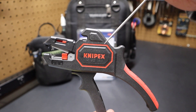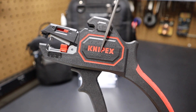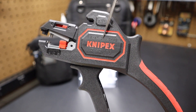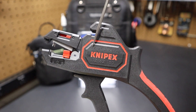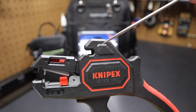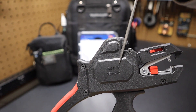I'll have a link to these in the description so you can check them out. Let's take a look at these wire strippers. You can see right here they have that Knipex part number, 12-62-180, right on the side. The tool is self-documenting, so right here they tell you it can do from 24 to 10 gauge wire — that AWG is American wire gauge — or 0.2 millimeters to six millimeters. You can see right here at the top they have a wire cutter, documented as well. It can cut up to two and a half millimeter wire. Flip the tool around — it's made in Germany.